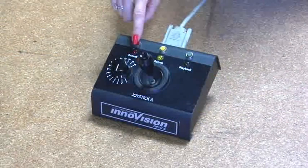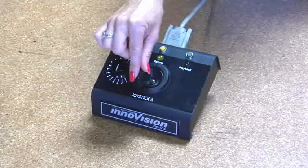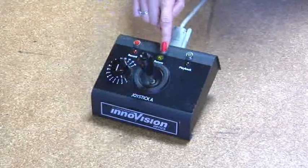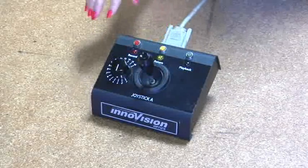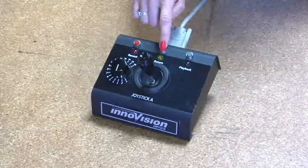I'll push the record button on, and now I'm moving the linear table. After I stop the move, I push the record button off, push the return button, and this brings the table back to its original position. Now when the yellow light turns off, I'm ready to push the playback button — and the linear table repeats its original movement.